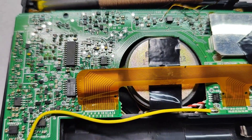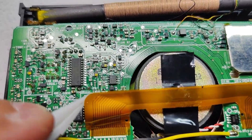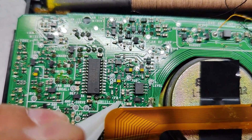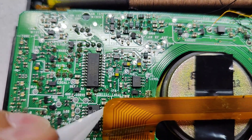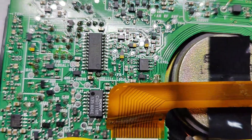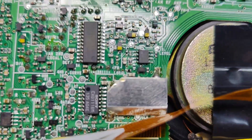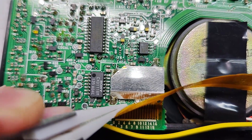When you open this a little bit, you will find three points. There is a description: FM local. You see — one, two, three. We will have to make a new bridge from the third pin, over this shielding, from this point to the point under the orange strip.